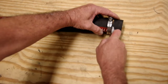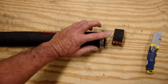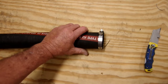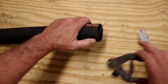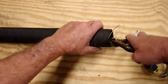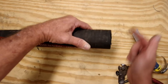Continue along the hose clamp all the way around, then pull the piece away. With hose this size you'll probably struggle to get a clean cut with small cutters, so that's when the heavy-duty wire cutters come into play — cut that and get rid of the waste. Move the hose clamp guide out of the way. There's our meat hook — we do not want to leave that behind. Come in as far as you can, perpendicular to the wire, make the cut, pull the meat hook out. Now we have a nice clean cut with no meat hook.